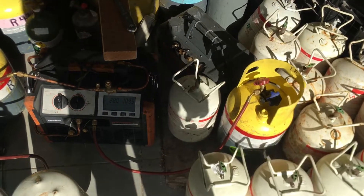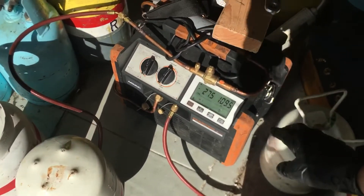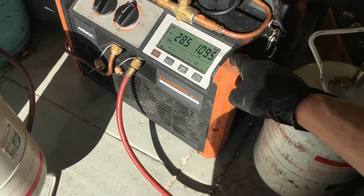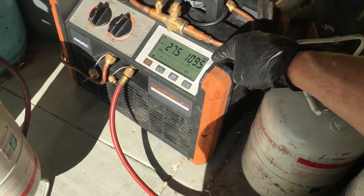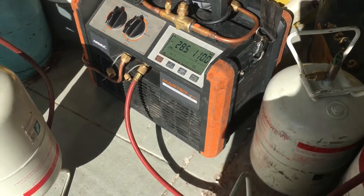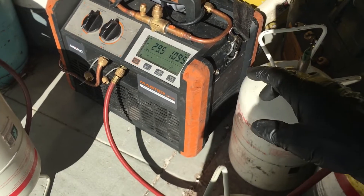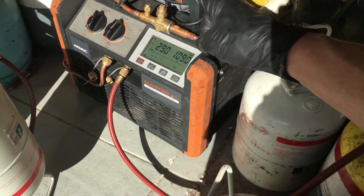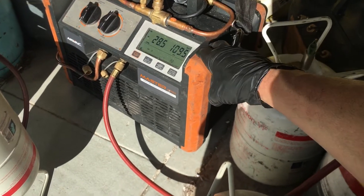So that's why this is a workhorse — it will basically stay on from morning until evening. When I start doing refrigerants, I'll start off with the YF here. Right now it's about 2 o'clock in the afternoon. Then I'll transfer over, clean out with nitrogen, evacuate the system — it'll be a clean unit again.